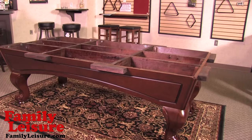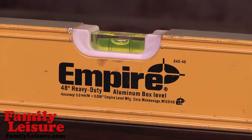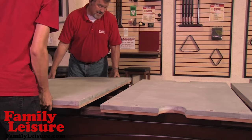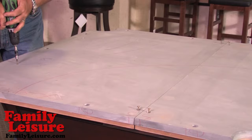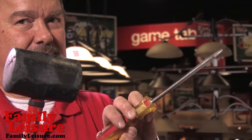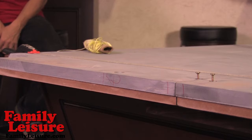Upon completion, it is now time to begin to level the table. Make sure the table is level from left to right and the length of the table before putting the slate on. Begin to place your slate pieces on the table, being sure that the center piece is dead center in the table. Your long screws will be inserted through the pre-drilled holes in the slate to connect to the support blocks. Begin by first connecting the four holes at either end of the table, then leave the rest into the inserts — do not tighten yet. A string is stretched across the slate to ensure the three pieces of slate are flush and even to each other.